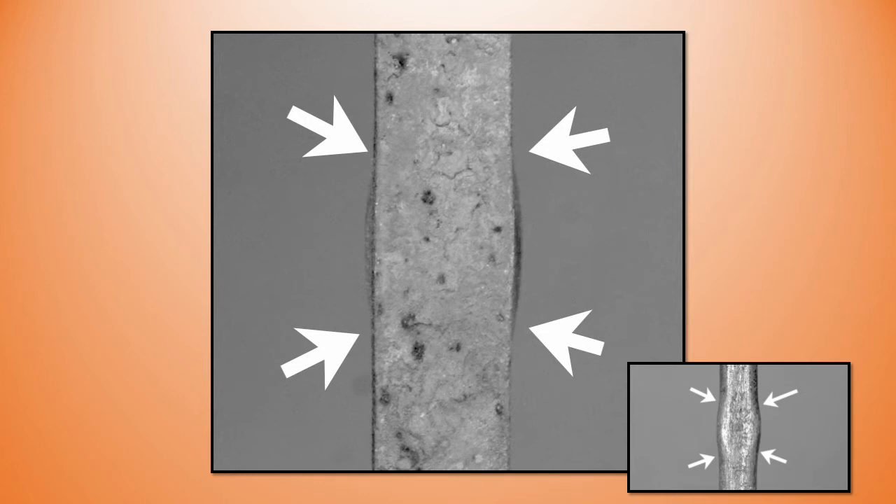Going back to punching to the middle of the bar: if I'm going to center punch, I only center punch from one side — click, stand the punch up, go to work, drive it halfway through, then turn the bar over. I use the swelling as the indicator for where to place the punch from the second side. In a two-step process: first I hold the punch splitting the two arrows — in the middle lengthways — then hold it widthways to make sure I'm in the middle of the bar. Over time you'll do that as one motion, whether using flat, square, or round bar.